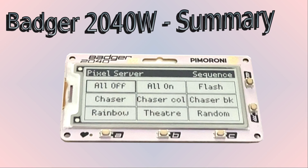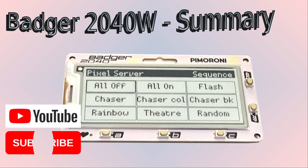The Badger 2040 W is a fun customisable e-ink badge — the added wireless means it's capable of much more. It can give live updates such as news and weather, but it can also provide a low-power interface for home automation. It's based around the Raspberry Pi Pico W which is very low power, and the e-ink display will only consume power when it's updating. You could also include a switch on the power supply and switch it on and off, and because it uses the microcontroller, the menu is pretty much instantaneous with no load time. In my next video I'll be showing how I created a custom menu interface for full custom control of my NeoPixels. If you haven't already subscribed please do so and click the notification bell icon. Thanks for watching — if you liked this video please give it a thumbs up and I look forward to seeing you in a future video.